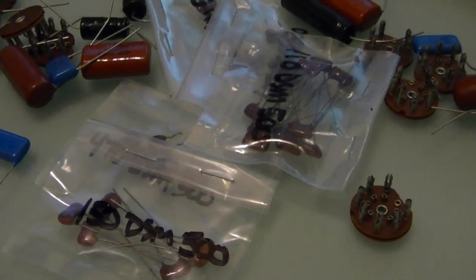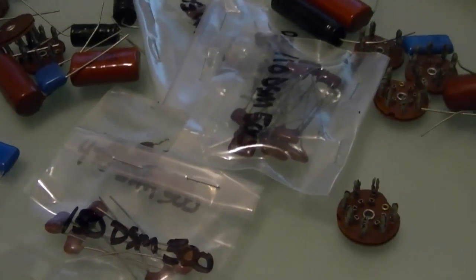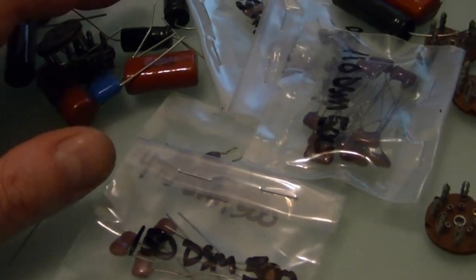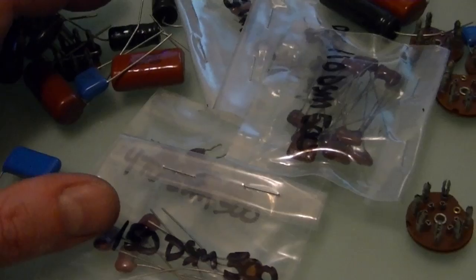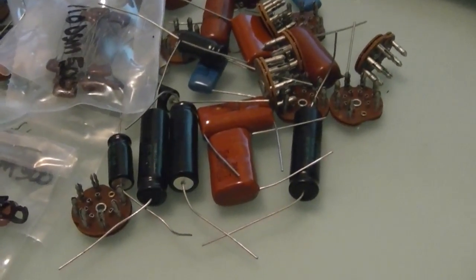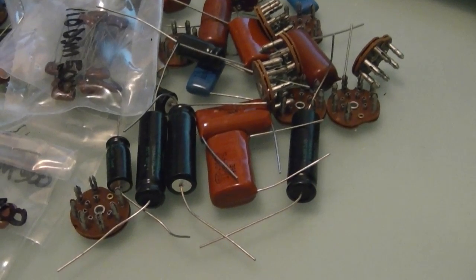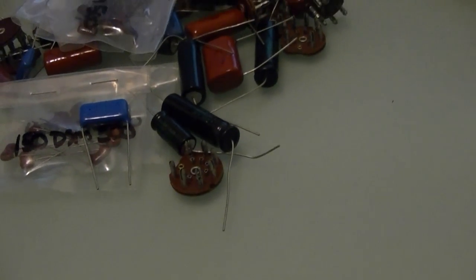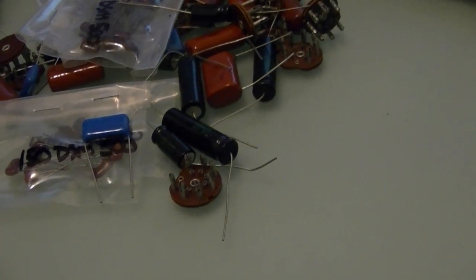Well, I guess I'm going to be ordering some mica caps, and I might as well go ahead and take out the other IF can, for that matter. I might just go ahead and take out all the IF cans, because if you recall, I mentioned that there was a power resistor inside of the video IF cans. I measured them. They're all 20%+ high. And I've got a few other Admiral sets like this to restore, so why don't I just order up a good half dozen of each type of mica value I might need. Luckily, Mouser ships quickly, although they're a little pricey when it comes to mica caps, but I should get them in 2 days, maybe 3 days at the outside.